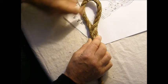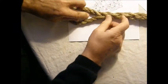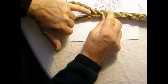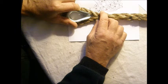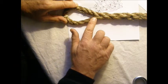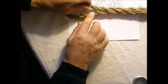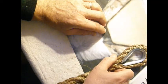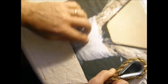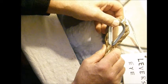This tuck of the leading strand under the aft, as we see right here, accurately defines the throat of the splice. This property makes this eye a natural choice when forming an eye around the thimble. Unlike the Sailor's, the Leavers does not have that protruding strand at the throat. However, to the credit of the Sailor splice, the back of the Leavers is not quite as tight. We can secure a thimble in an eye by wrapping seizing around the two arms at the throat, as shown in this photograph. The Leavers eye can easily be made to a size that avoids the need for that seizing.